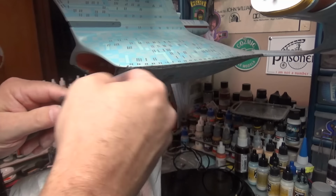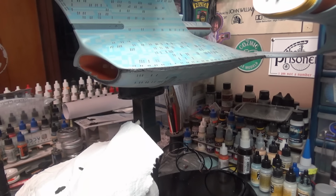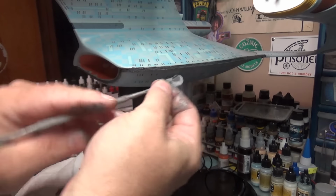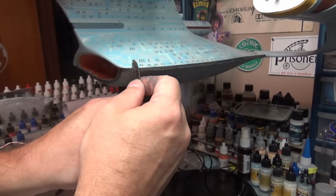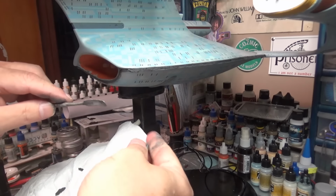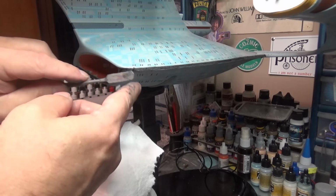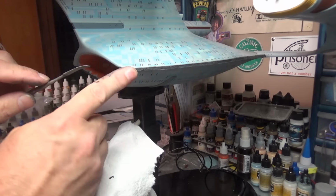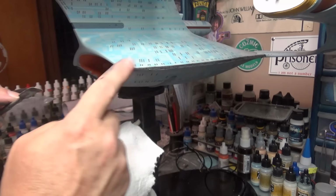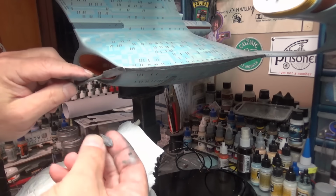And I'm keeping the back of this tool wet, which is plain water. Got to keep it cleaned off, and just pushing it in like that, and then running a level around it to scrape it to get the high spots off. And I'm taking this little bit that I am getting ready to finish up with, making sure that I'm not leaving too much on the outer edge here that has to be cleaned up. Get that off while it's still wet, so to speak. Makes it easier to clean that area off.